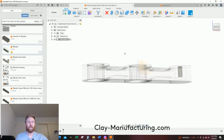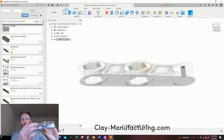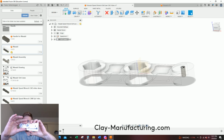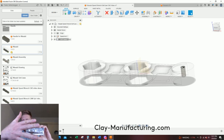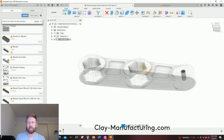Now, I know I've machined this top side. It's got the threads in it, so I've machined this. What I'm going to do is create a sketch plane based off of this surface I already did. I'll create a sketch plane, extrude the jaws the opposite way, then joint this into the jaws after I project a sketch and everything. So one more time, I'm going to create a sketch on this outermost surface that's done. I'm going to sketch out my jaws, extrude them away from the part, and then I'll inset this into it. Hope that makes sense. If not, it'll maybe make more sense while we're modeling.